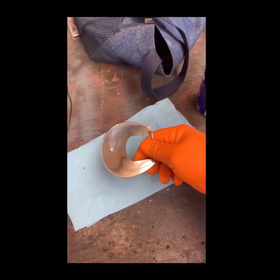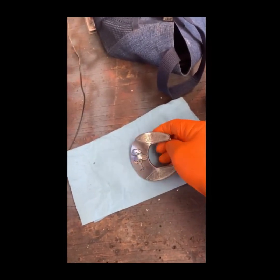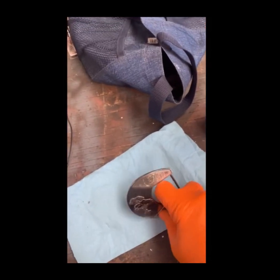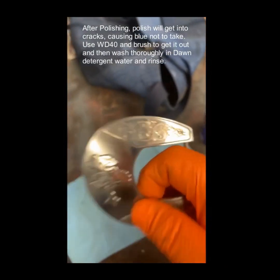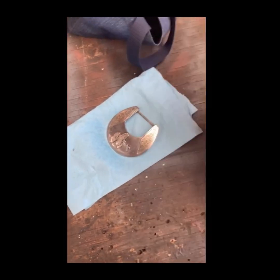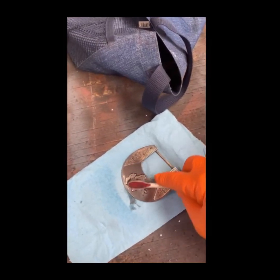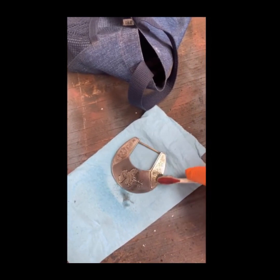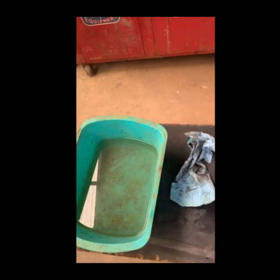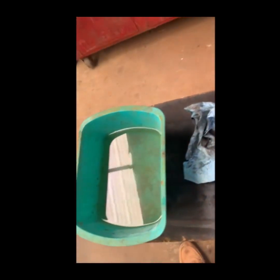Here's a buckle I'm going to blue — I cleaned it up really good. After polishing it we have a lot of black polish down in the cracks and crevices. We have to get all that out before we try to blue this thing. So we're going to use some WD-40, spray it on there and scrub it really good to get all that greasy polish out. I try to polish my items before I blue them because it makes for a really shiny blue finish and makes it look really good. Then I have a bucket with Dawn dish detergent in it. Dawn is really good for degreasing things and cleaning them up.